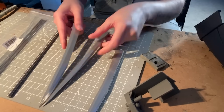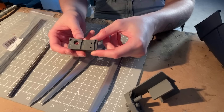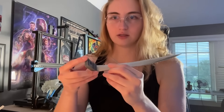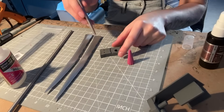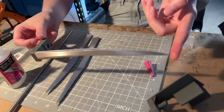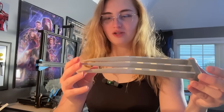First, start with the claws. These mount to the claw carrier piece — you can see the slots cut out for them. I use Bob Smith Industries CA glue to glue them in place; you can weld them instead, it's up to you. You'll want to glue these in right away because you'll start installing things together and they just need to be in place. There are the claws glued in — my middle claw got a little uneven but it shouldn't be an issue.